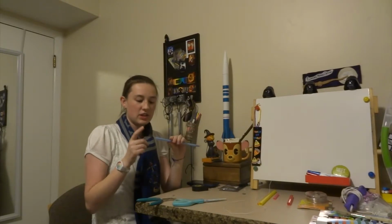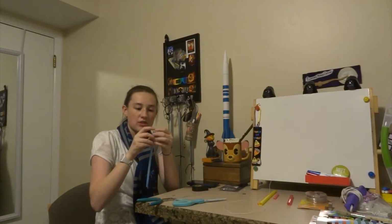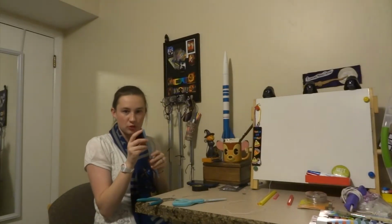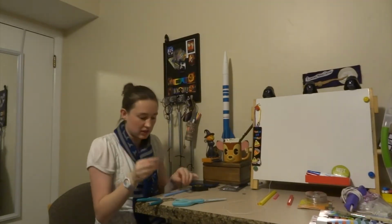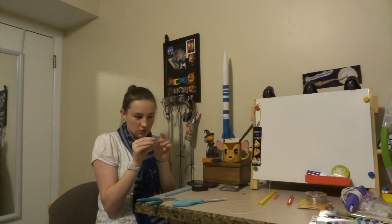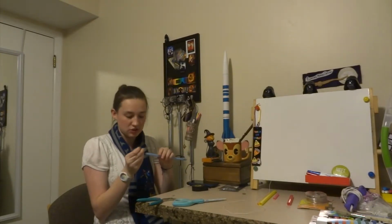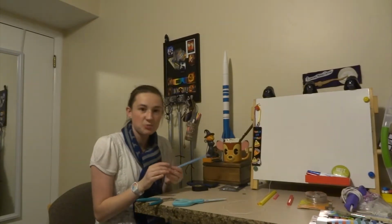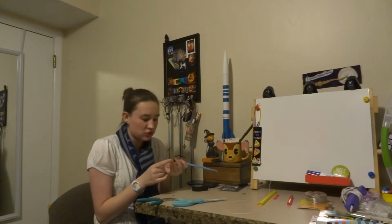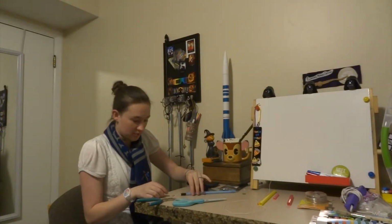Now we're going to want to attach some of the wires to these switches. So I'm going to take one of these wires and attach it to the bottom of the loop. And now this is when I bring the short wire into the mix, and I'm going to attach one of the ends of the short wire to the end of the switch. I'm going to put the switch back on and then tape them together just so they'll stay in place now. At this point, you might need to double check whether the short wire is the positive or the negative one, so let's double check that with our batteries again.